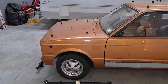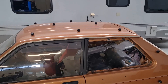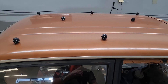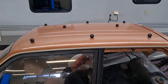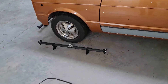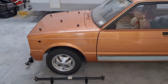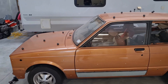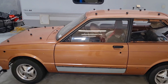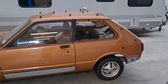You can see some 360-degree 3D-printed target dice with targets in all directions. The software will automatically remove them upon finalizing the mesh data. We also have scale bars in the scene to improve volumetric accuracy. For example, the HandySCAN MAX Elite can achieve 15 microns per meter, plus 0.1 mm accuracy.